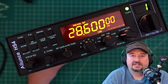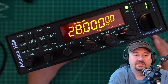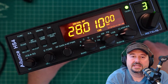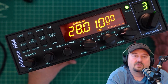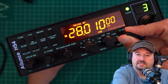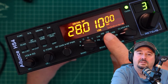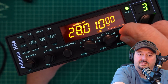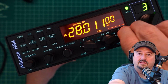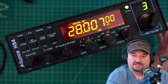A lot of folks are not accustomed to this. Some will say, well, how do I get on a particular frequency? Let's say you're on 28.000 — you go up to channel two and you've made a jump to 28.005, then one more and you're on 28.010. You say, well, I want to be on 28.007 — how do I get there? You have this knob called a clarifier, and the clarifier will allow you to make certain adjustments. You can hit this button and it will cycle through different digit values you can change. And there we go — we're at 28.007. That's how you dial or tune this thing in.